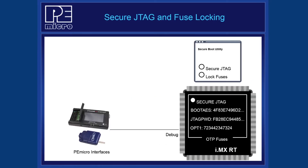For production programming, there are additional security concerns that need to be addressed. As we saw previously, the eFuses contain very sensitive security information. If any of these values are read, the security of the product would be compromised. Before any products are shipped to customers, we recommend enabling two security settings in the Secure Boot Utility. Normally, an attacker can use the debug capabilities of the processor to read out the eFuses. The Secure Boot Utility has an option to enable Secure JTAG, which requires the user to know the right password before debug mode is allowed. Without the password, no debug access is possible, and the eFuses cannot be read.